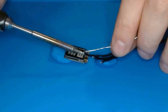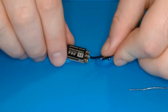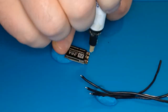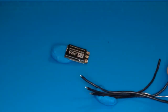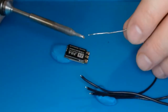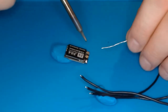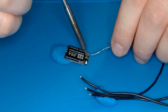You don't need huge globs of solder on the end of your wires — just enough to hold all of the wires together. Then we're going to add some flux to the pads and tin them. Put some solder on the flat spot of the soldering iron, touch it down to the pad, then touch the solder to the pad and slide it into the soldering iron.